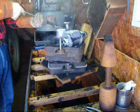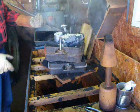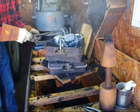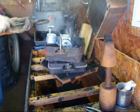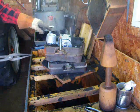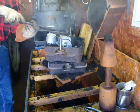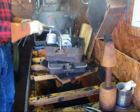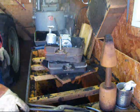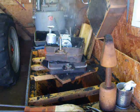Take a little wire brushing. Now this is going to take about an hour or so to cool before I want to quench it in water. This is the sprue right here where I poured the metal. This is a riser that was going to be used to control shrinkage, but I don't see much shrinkage here or here. I expected a real big dip here, but I don't see that right now.